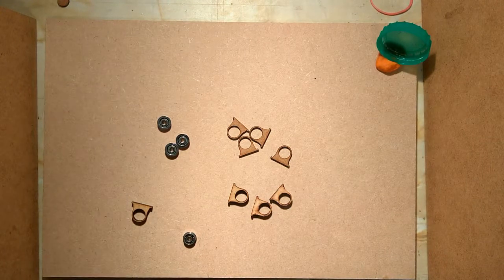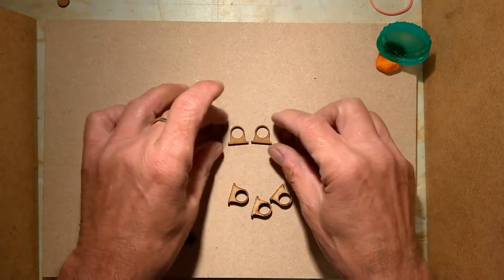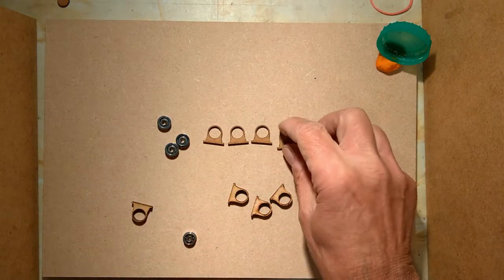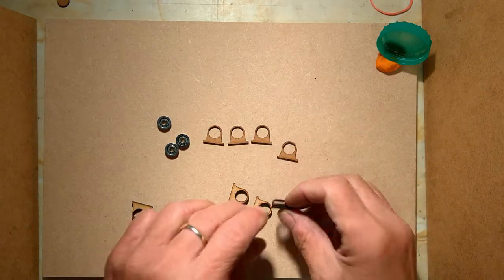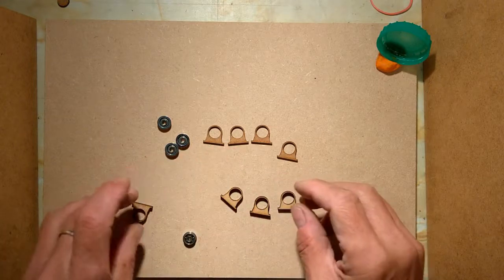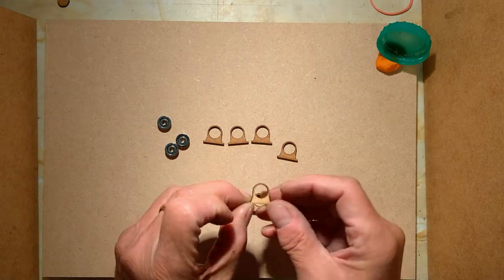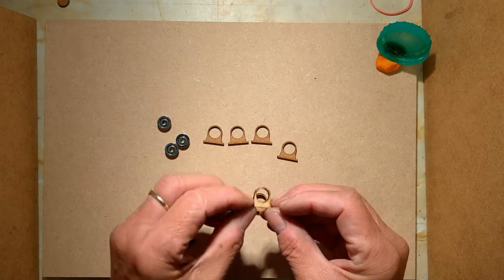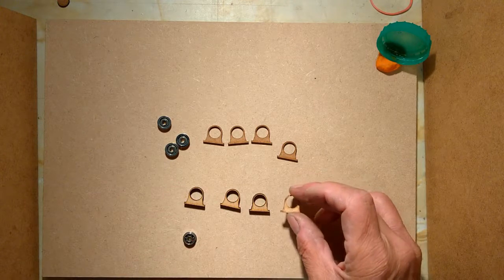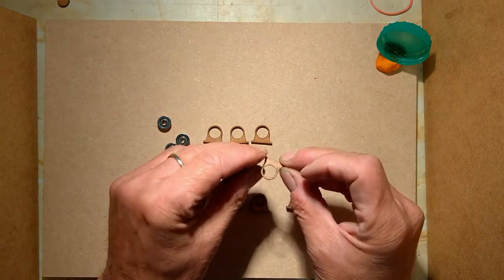This is construction of the 3-bar Slate Wagon. We'll start off by putting the bearings into the bearing holders. So you need to locate 4, they look like old-fashioned clocks, and they are 2mm thick, and you need to locate the ones which are 4mm thick. Again, there'll be 4 of them. They have a good side and a bad side. The good side is clean, the bad side is dirty. This is important when we come to assemble them together. We have exactly the same on the thinner ones. You have a clean side and a dirty side.